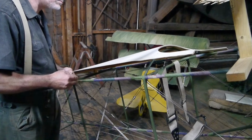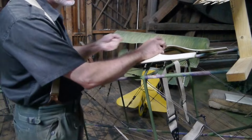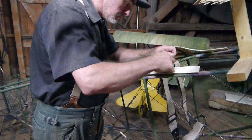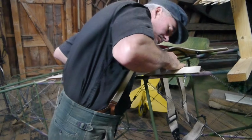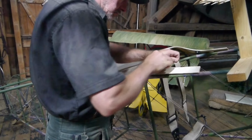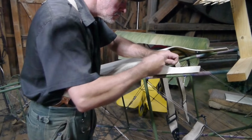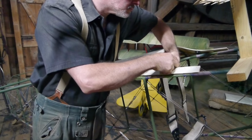Incidentally, what you often see in replicas of others who work according to the drawings of Walter Redfern or Ron Sands is a substructure made of a bent steel tube around the cutout of the cockpit unit. This was only used by Fokker up to the D5. The sturdy new turtle deck means that this tubular construction can fall away and has also not been used since the triplane.